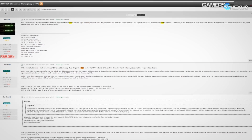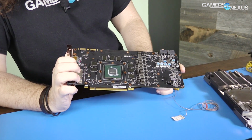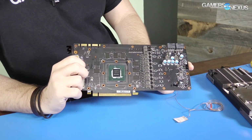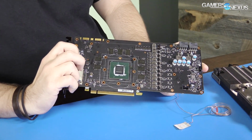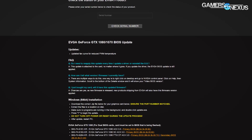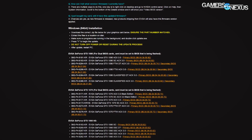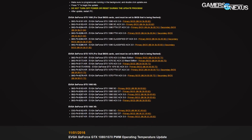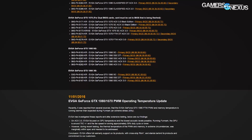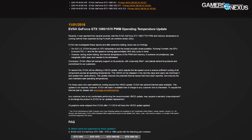Oh, and one more thing. Some posts claimed that black screen issues on EVGA's first batch of cards were caused by VRM's overheating. That's wrong on many levels. A thermally compromised VRM will not throw a black screen that can be fixed by a restart. It'll go up in a puff of smoke, and you'll never be able to turn it on again. That's how they fail. The black screen issues have been resolved by EVGA and were, unfortunately for the company, another in a long list of issues and resolutions for this series of graphics cards, but they're not related, as far as we know, to these VRM thermal concerns.